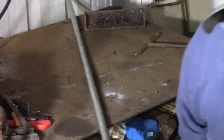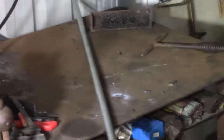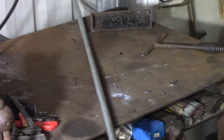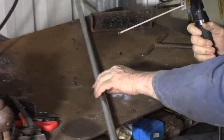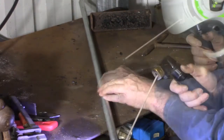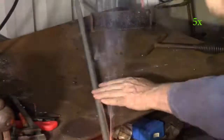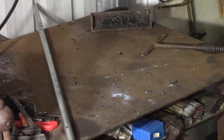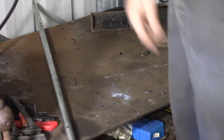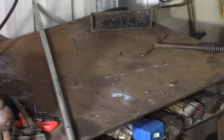I'll go around that and give it a good weld. Maybe with just a few more amps — another 5 amps or so. Yeah, 5 amps helps. That'll do it. So I'm going to get that packed in with sand and light weld on the other end, so that the gas can escape, and it should be ready to heat up and bend.